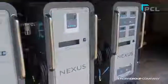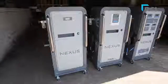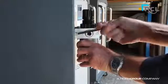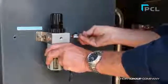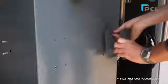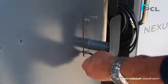Installation and setup of the units is very simple. Before power-up operation can commence, the user must install the air filter bracket and hose hanging brackets onto the outside of the machine. This is done by holding the filtration unit with brackets attached in position on the left side of the unit and screwing the 2 nuts and washers into the holes next to the compressed air outlet using a 5mm Allen key. Repeat the process for the 4 hose hanging brackets, locating 2 on each side in line with the holes in the cabinet sides.